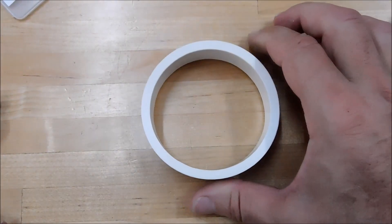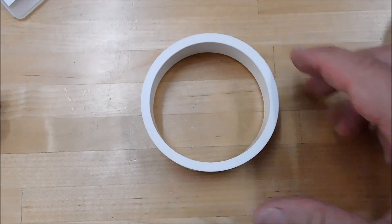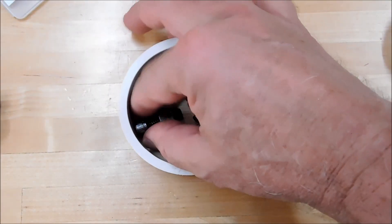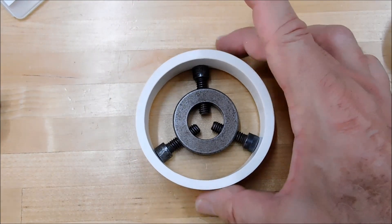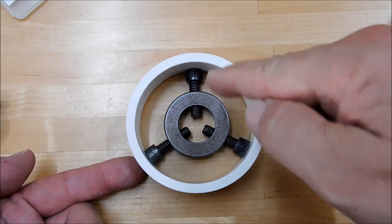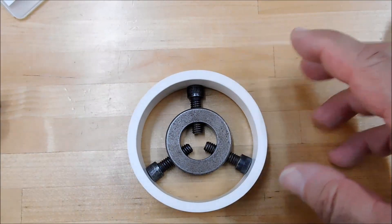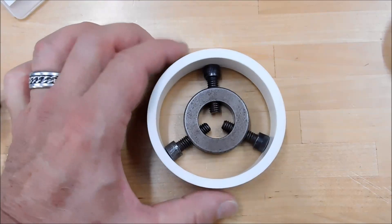How I would do this — and unless you want to have a stack of plugs alongside your machine that you consistently alter — here's your solution: a jaw spider. Stick it in there. This is the same spider that I use to bore my soft jaws. When it just lightly drags, you are good to go. Make sure that your jaw contact is in this area right here. And it doesn't matter if this is egg-shaped, oval, round, or whatever. When you do this and it's in line with the jaw, the chances of distorting this part are somewhat reduced. I'm not going to say it's eliminated because everything has its point of yield, of course.